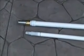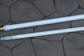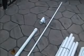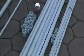Pipe on the bottom is the piston. The section's about 3 feet long, and then I have it adapted down to 1/2 inch PVC. There's the T that's going to go on top of the 1 1/4 inch pipe. This is just the other materials I've got to put it together with. And these are the keeper blocks, I guess you call them, that I'm going to put around the 1 1/4 as I insert it down into the well so it won't fall in.